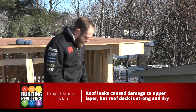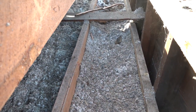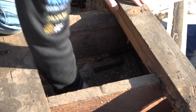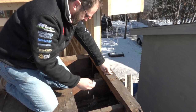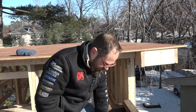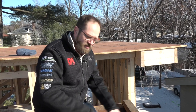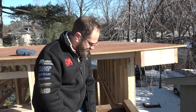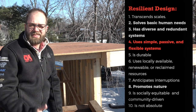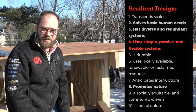So we also have a huge opportunity now. We have this two-foot cavity between the old roof deck and the plaster ceiling below, and there's currently about two inches of cellulose in here — not enough for Minnesota. But we have this giant void, so what we're going to do is come back, net all of this on both sides, and fill the cavity full of blown-in fiberglass insulation. We'll end up with 24 inches of insulation, which is pretty close to R80. It's more than enough, and the house should be pretty comfortable.